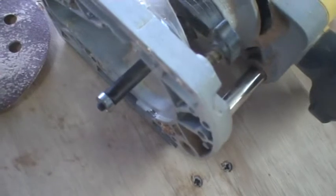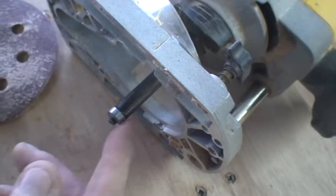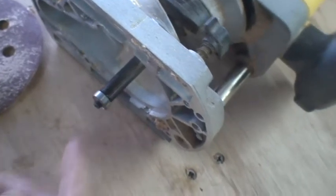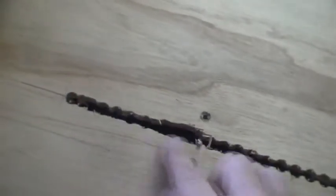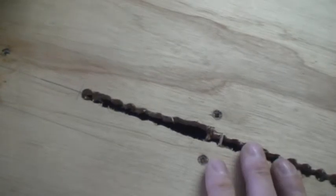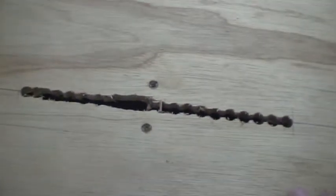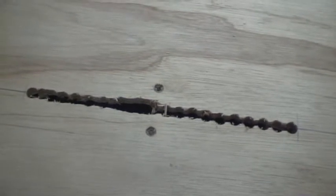You can see here I've cut the centre case slot by drilling a few holes, and at this point I've just widened it out. I'm now going to trim it out with my router handheld with the trim bit, which should run around the inside of the centre case and trim the edge nicely to the centre case. If you don't have a router, you'll need to use a series of saws and chisels and whatever else — but if you have got one of these, it certainly makes the job easier.